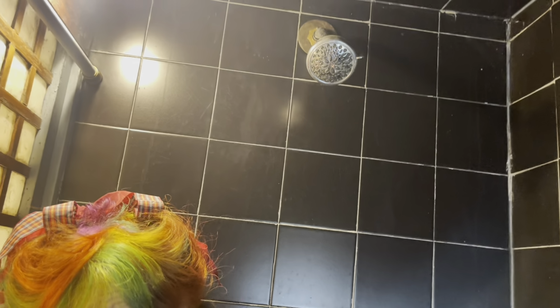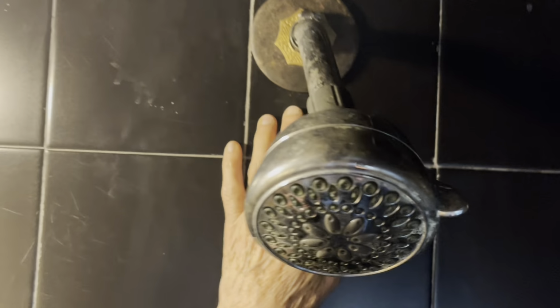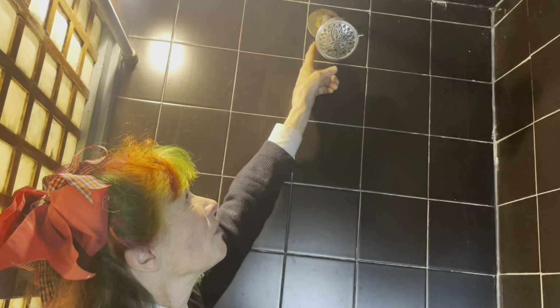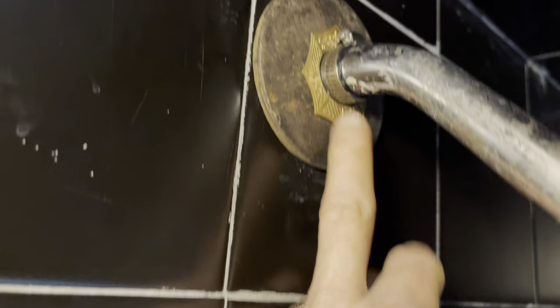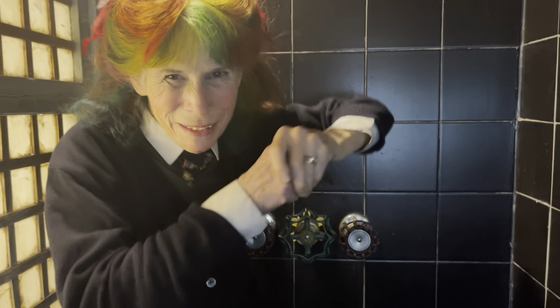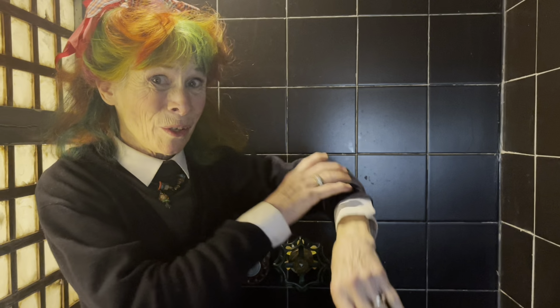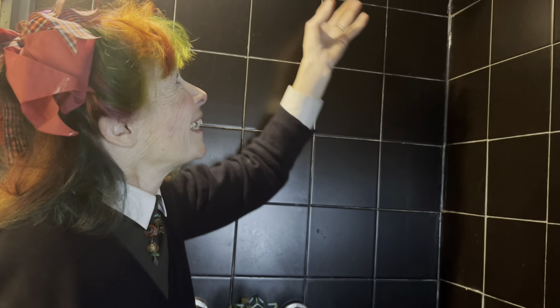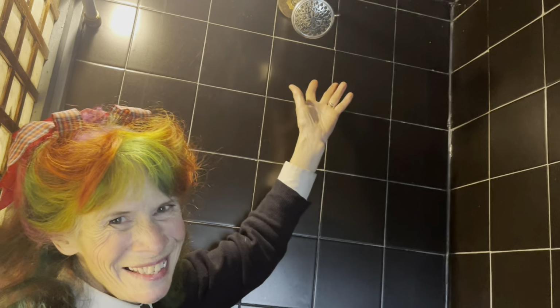And so this is a very large washer, the kind used in very big industrial situations. And then this little beautiful brass piece that we happen to have was part of our work with lamps and so forth. And then we used a hose clamp. If you look very closely, you'll see the little ridges of a hose clamp right here. And I put a little piece of rubber under there so that when Bob tightened it on, it would grab that rubberiness and have something to really press hard onto. Because those clamps are built for hoses, it needs some rubberiness to give it all of its strength and pressure. So that will never move, and it didn't have to be glued into place. It could just be treated as if it was a piece of the plumbing. And so now the shower head has a nice entrance into the rain locker.